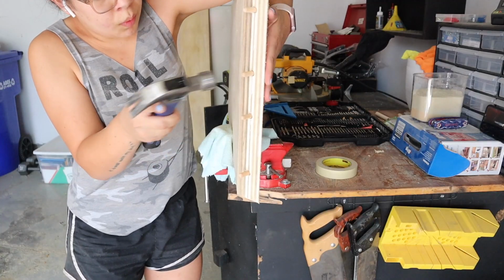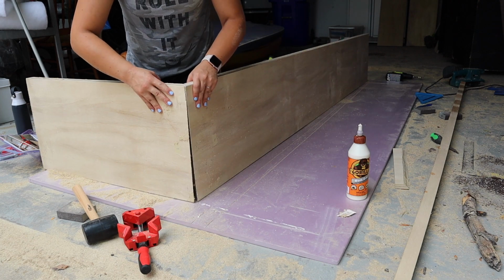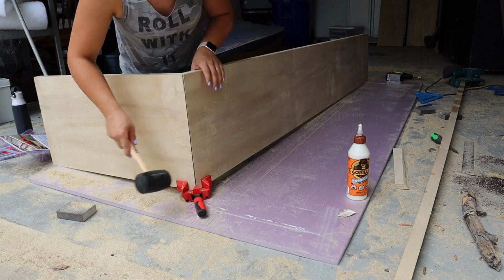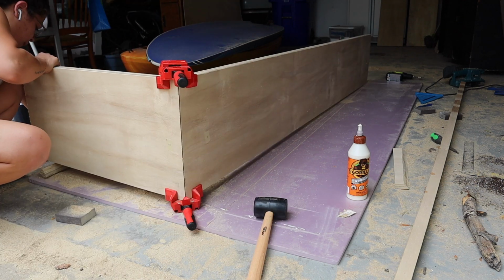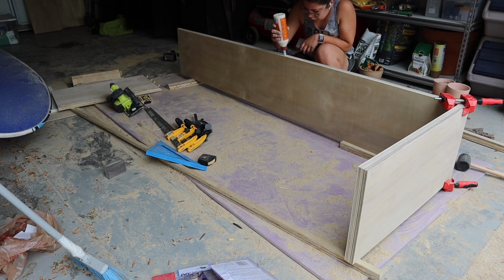I glued the dowels into the legs first. Once dry, I glued them into the top and secured the joints with right angle clamps. I only have 2 of these clamps, so I could only do one leg at a time. While each one dried, I used scrap pieces of wood to raise the whole piece level and started filling in any imperfections with wood glue and sawdust.